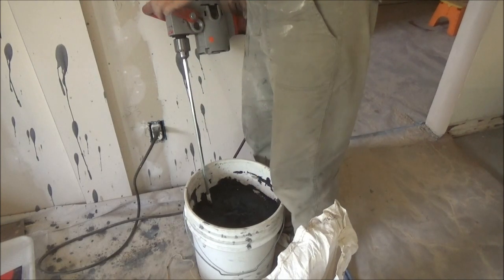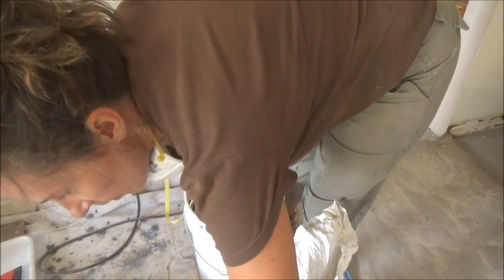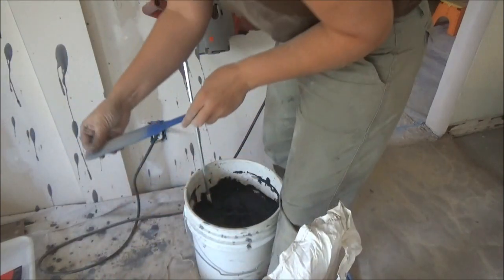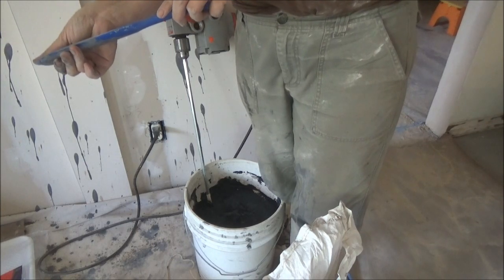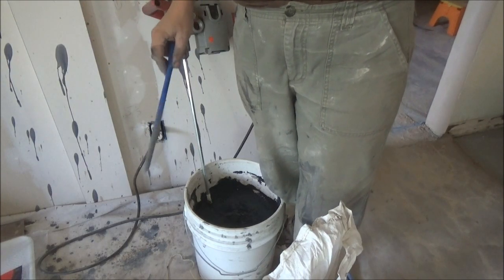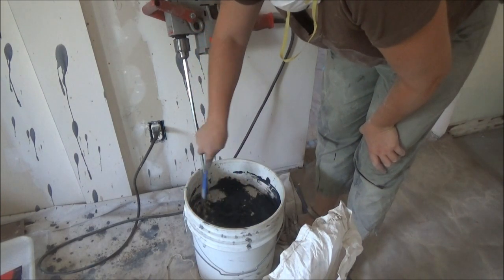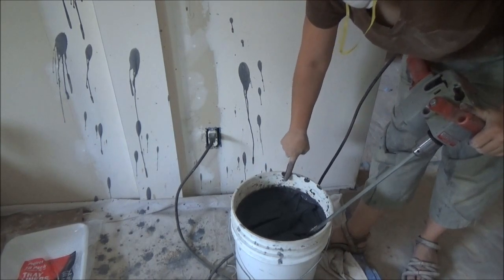This over here is already done? That's my first coat. I have to go over that again. Is it dry? Yep. You can touch it. You won't hurt it. Oh, wow. You can feel with the first coat, the primer, you put sand in it, and that provides a grippiness so the clay sticks to the wall. But when I get the second coat on, it'll be okay. I think we're gonna call that good for that.